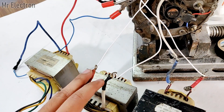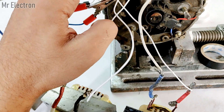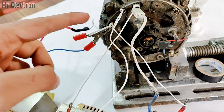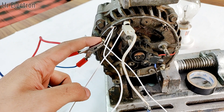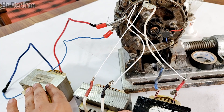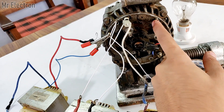Now coming to this transformer — these two wires are connected to this one and this one. The only remaining wires are these two, which have not been repeated, so this transformer will be connected to these two. There are two connections for every terminal coming out from the alternator, so all three phases have been connected to the three transformers in delta format — not star. It would have been star connected if I had utilized this neutral terminal of the alternator.